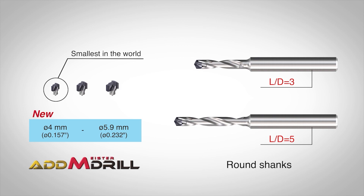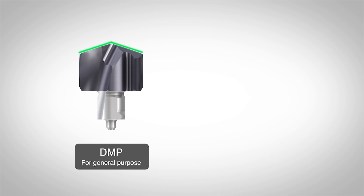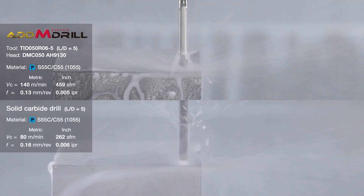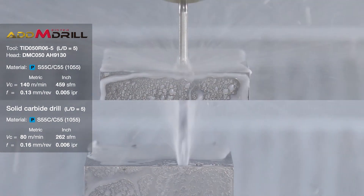To start off, the system is an indexable head drill. The benefit of that is you're not just buying one size of drill as you would be with a standard monoblock high speed steel or carbide drill. Once you buy a body on DrillMeister, you can change the diameter by changing the head. They have a diameter range — for example, around a 14mm drill goes from 14mm through to 14.4mm. Once you get above 15mm, the bodies start to have a full one millimeter diameter band range.